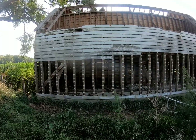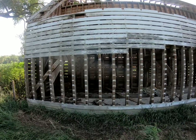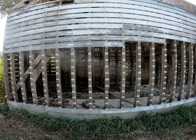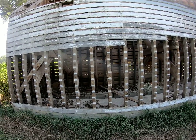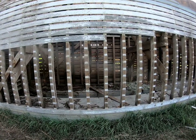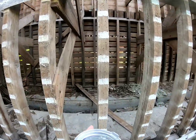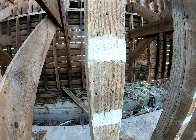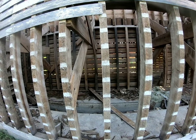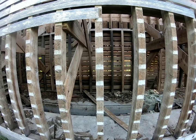I have a pry bar that the neighbor guy gave me. I had to modify it because he had designed it to tear a crib down one time and pull these outer boards off, and he gave it to me and said I could have the tool. He didn't want it back. It's made for 2-inch studs, and these are 3-inch. These studs are 3 inches wide, and the gap between the claws was only 2 inches, so I had to modify it. I took it to my son's and we used his plasma cutter to widen the gap so it straddles that stud.